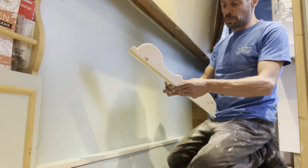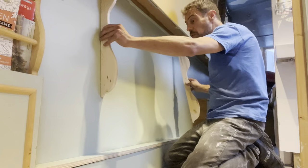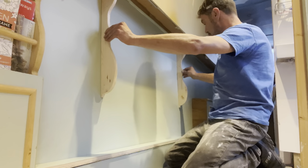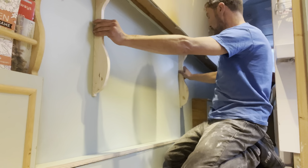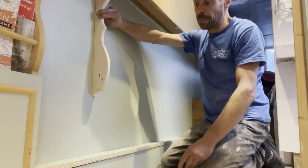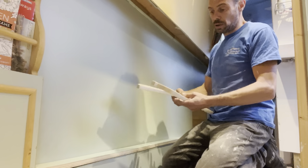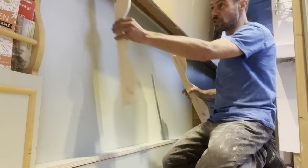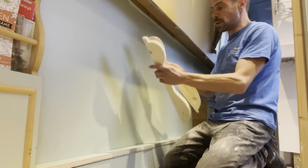These are my two pieces — sanded down with 240 grit, which is about as low as I went. I've contoured them, scribed them to the contour of the boat. The nickel-plated tube is six foot long so I've basically got three foot each side — about that — and I've got to have a gap here for the door to close. All I've got to do now is wax these, drill the holes, fit it in there, and cut the tube. Using my hole cutter to put a couple of holes in here — I want them as far out as I can so I've got some bulk for the towels to hang onto.